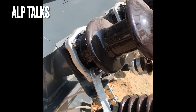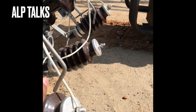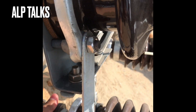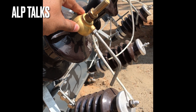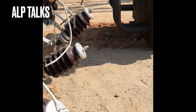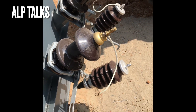The bushings are on this side. You have one lightning arrester here. You can observe the lightning arrester top and the bushing top — both are connected. The bottom of the lightning arrester is earthed here. This is the earthing arrangement. Whenever any fault occurs or any surge happens on the transformer, it will simply be grounded. You have both arcing horns and a lightning arrester as well — both may not be required, but it is good to keep both arrangements.